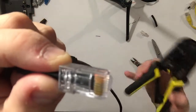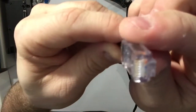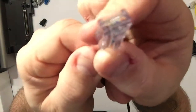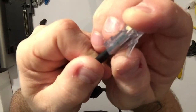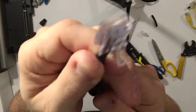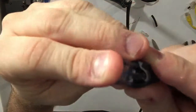I'll hold it in place while I bring my crimp tool in — the 8-pin section. Crimp. I always go twice with the crimp. And you'll see that it is on there pretty snug. My wires are all good, and I'll again just double check the order — you can see them through the clear connector. Another little thing I like to do: you've got the tab that holds it in place when you put it in the socket — I like to pull it out just a little bit before I tuck it in the boot, as that helps it clip better as it goes in. So I can slide my boot up and put it around the connector, tuck that in place.